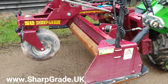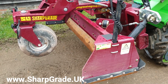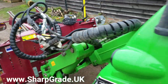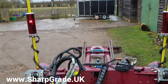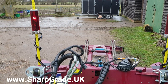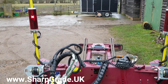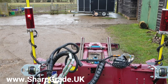Now as you can see, we've put down the front frame and wheel — this allows you to carry the blade rigidly so that you get a lovely accurate finish. If I jump up into the driver's position, you can look in the mirrors and see the wings of your machine and the material you're carrying, whether you've got anything in the bucket or not. So you can sort out what load you have or haven't got, and you're not wasting time thinking you've got something in the front when in fact you have nothing.